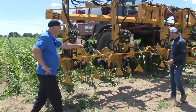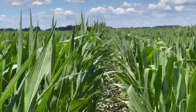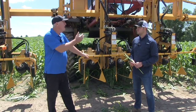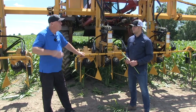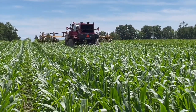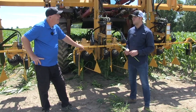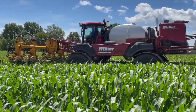Four rows at a time are in a bank here, and then there's a gap — because this is where the male row has to run. You don't obviously want to cut the tassel off the male inbred. Then another four rows, and we repeat that one more time. It's primarily a four-in-one pattern for seed fields in this area, so you're doing essentially 12 rows and leaving the males as you go down the field. As for travel speed, in a perfectly consistent field you can see speeds of up to 15 miles an hour for cutting and up to 8 miles an hour for pulling. That speed comes down pretty quickly with variability — you've got to slow it down to allow it to do its job.